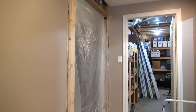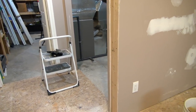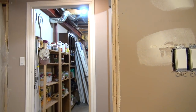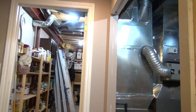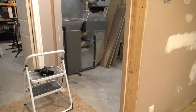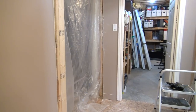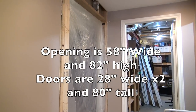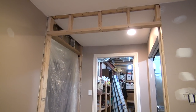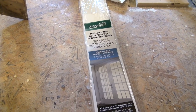I opened it up as much as I could, which ends up being 58 inches. It's kind of limited because it had to line up with that wall over there so we can maintain the closet where the furnace is. The door frame is about two inches bigger in width and height than I need, so I went with 28-inch doors — 58 inches wide and 82 inches high.